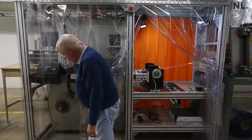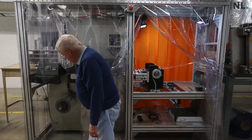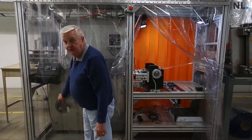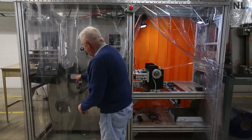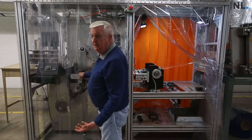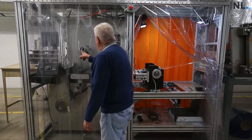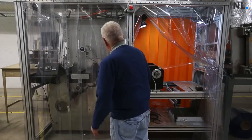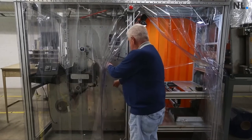The base film is right here. You can see it's clear polyester film, 6½ inches wide. It'll be 13,000 feet long when we start coating. And it goes in here, runs through a static treatment that makes sure there's no static building up as it runs through the machine.